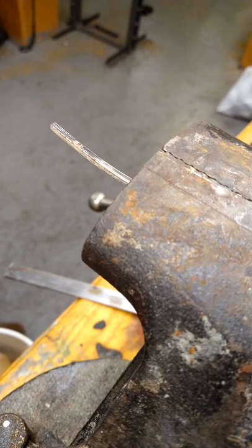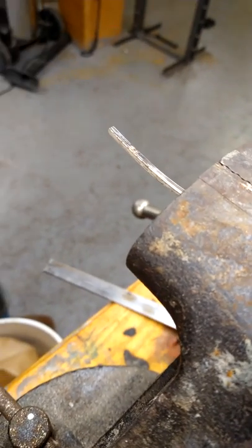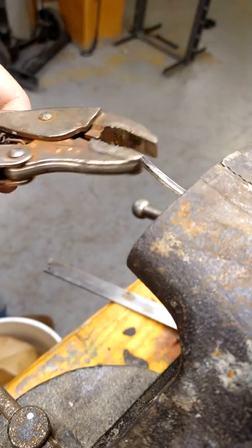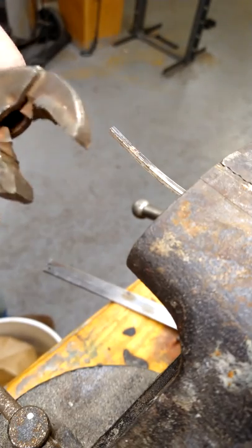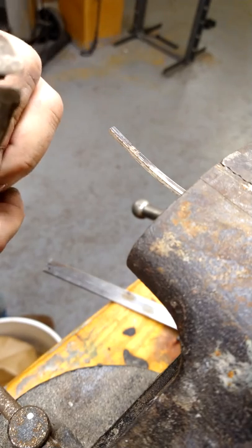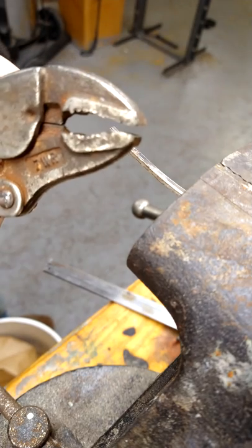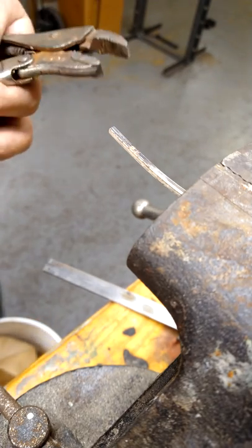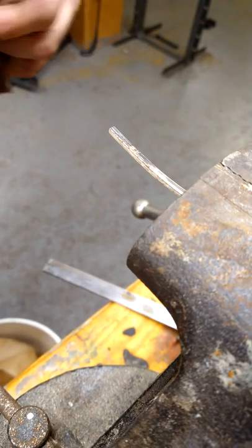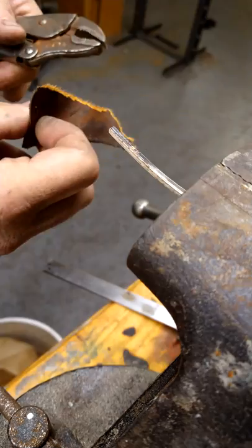Alright. So yeah, we have the no teeth on that end, but we've gone above and beyond that. This was a great idea. Locking jaw pliers, ground flat. So what we essentially have is locking really tight, parallel pliers that won't mar the metal up. This is ultra important for just about every reason. Especially with mokume-gane, you rip into the layers and it's a mess.